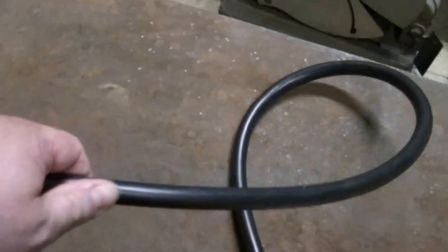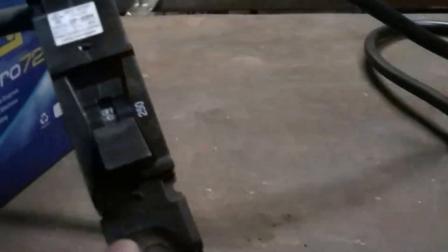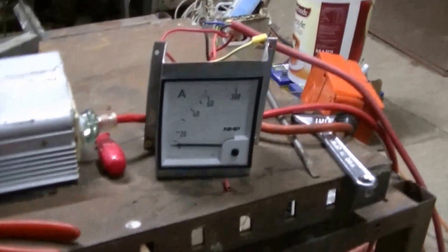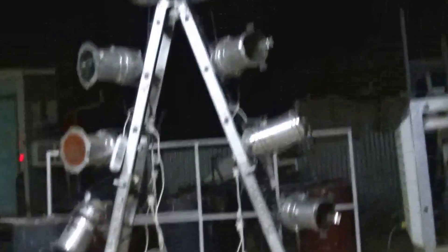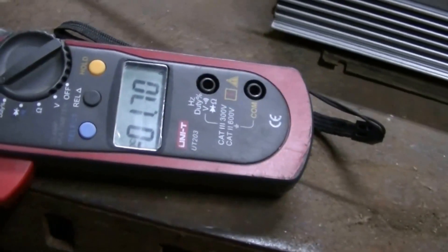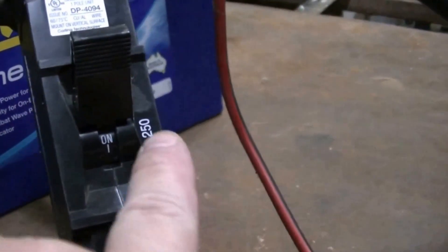I'm using this 250 amp safety switch and I've got the inverter and I'm going to show you why wire size matters and why sizes of fuses matter. I've got it all set up, we've plugged the lights in, I've got my little remote switch panel so we can gradually turn the lights on one at a time and put 300 watts of load on. I've pulled out the amp gauge off the 12-volt side and I've just got some 4mm DC cable running between the inverter — the old trusty 250 amp fuse should handle that no worries at all.